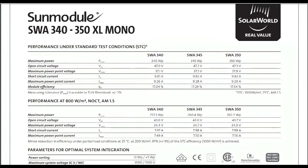One thing I want to tell you is when you're picking out panels, pick out the panel without cost in mind — the most efficient you can find — and then whatever that model is, search it for the best price. The efficiency is the most important thing. These are 17.54%, which is high. The polys went up to around 15%, and the monos have been increasing in efficiency ever since.